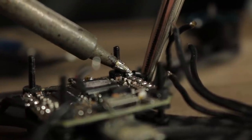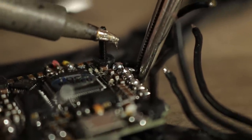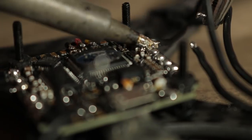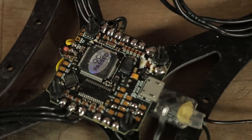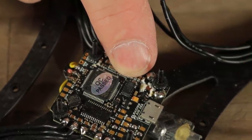Make sure to clean your solder tip as often as possible — it keeps your solder looking pretty, shiny and fresh. If you have any problems where the solder pops up and creates a little peak, just go ahead and desolder it and re-tin both surfaces with fresh solder and you'll get a much better result. Now this particular flight control board ended up in the water in our episode of the Outlaw. Pretty much everything was still working after this thing dried out, so that's pretty good testimony to this setup.